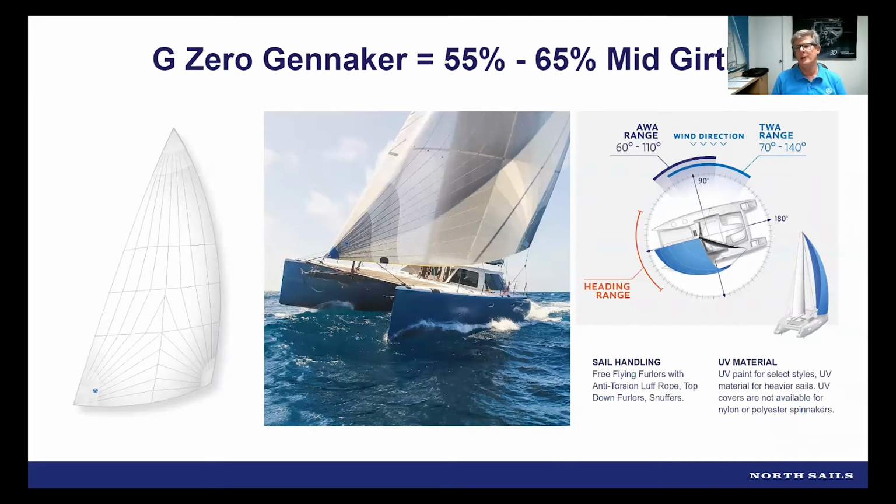Guys, I want to tell my Chicago boat show story here, because we're all salesmen. I go up to a Code 0 furling booth and I'm asking the guy about all these things, and he says, "Oh yeah, we have a fuse in ours." And I said, "Well, I'm looking for a lock." He says, "Yeah, the fuse won't guarantee that it won't roll out, but it'll prevent it most of the time." So I came away from that, like what Bob said, the fuse is just part of it. So remember, if you're told that the drums have locks, they're fuses.